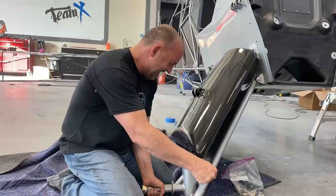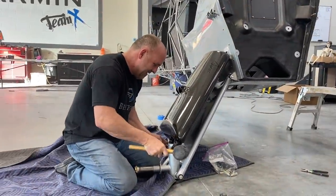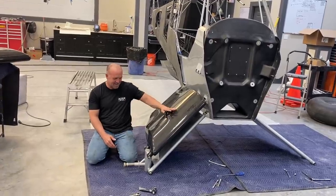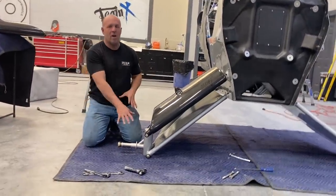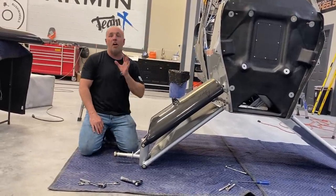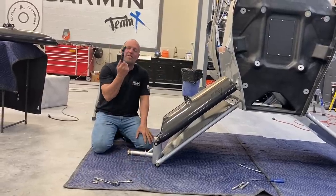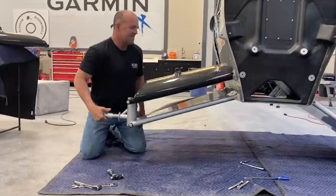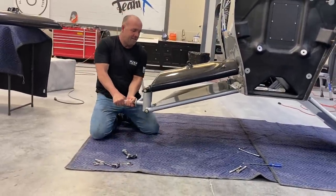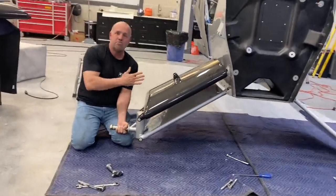This is the last bolt. I just tightened up all the bolts — I still got grease coming out everywhere. I built this with virtually zero tolerance on everything. All the welding was in a jig, everything was machined to fit, every tab on the airframe had machined spacers to hold them as I welded them in place. It went together with just a gentle persuasion of a tiny hammer to align the bolts and they slid right in. What's really awesome is look at this travel — if I grab this and try and wiggle it, even with a three-foot leverage arm, I can't get any movement at all. Absolutely zero play in this suspension.